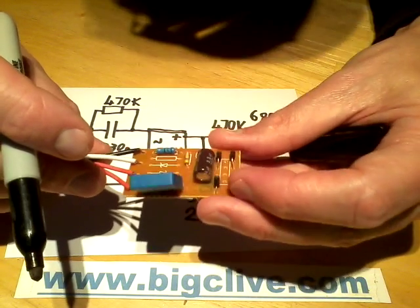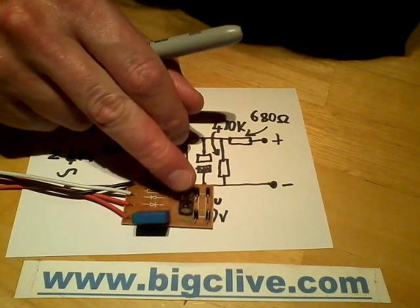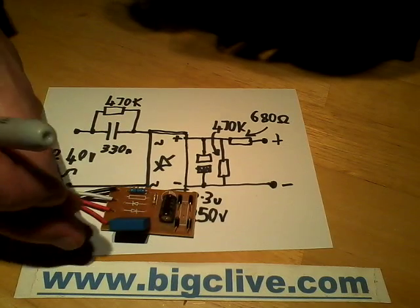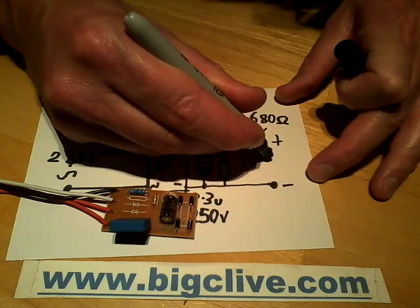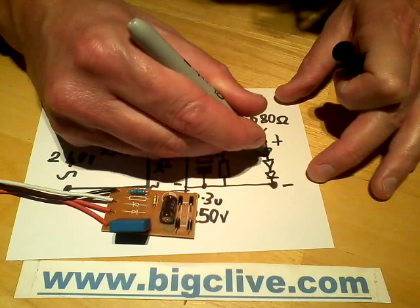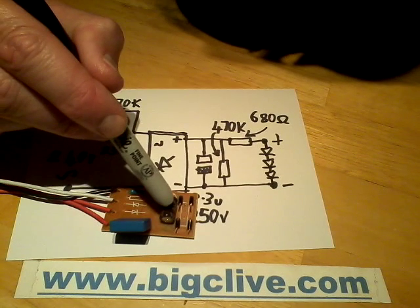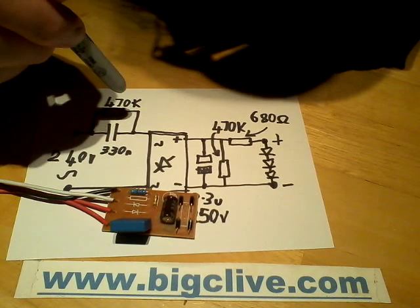So, I have to say, that's pretty much what you'd expect, but I would have preferred if this capacitor had been rated at least 400 volts or 350 volts minimum. The 250 volts is just a wee bit too low, because if the output circuit of LEDs, and that is just a chain of loads of LEDs in series, went open circuit, I'm guessing the voltage across that would go up to about 330 or so volts, and it could actually make that capacitor pop and blow its guts.